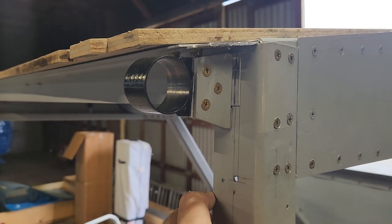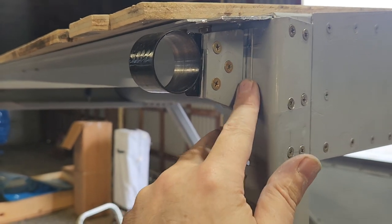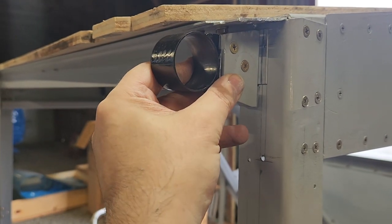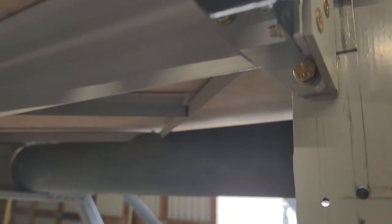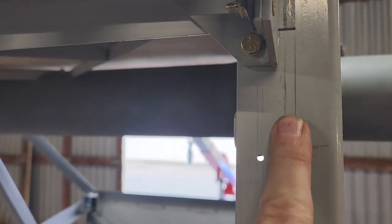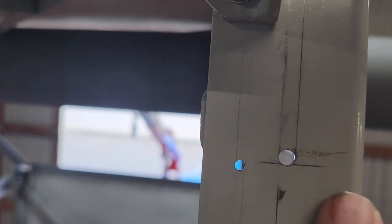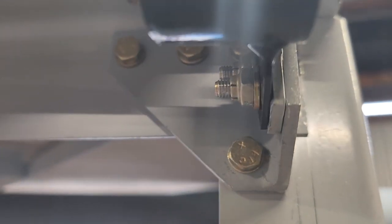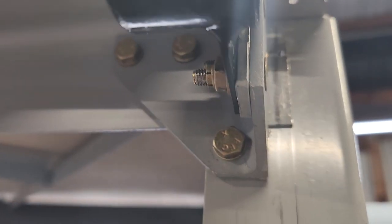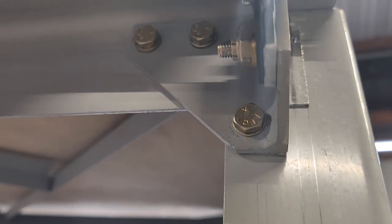And if it is, I'm going to run and get those, because I really need those to make this slot here. I'm going to have to take this off. Like I mentioned before, there's a spacer. According to the drawings, this has to be right here. And it actually does match if you measure down there. It's the same distance from the edge. So I just had a thin spacer, and it ends up that the thickness of a scrap aluminum is exactly the right thickness.